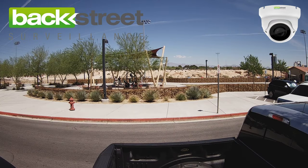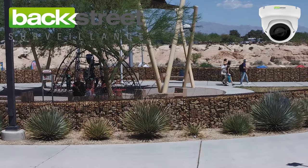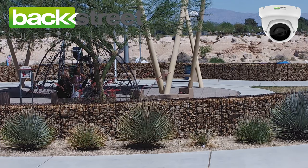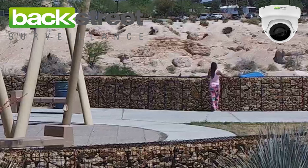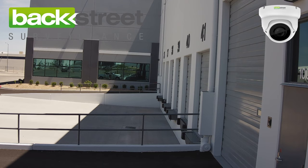The U90 VW is an extremely popular camera. It can be used indoor or outdoor. It can be wall or ceiling mounted. It's got a manually adjusted zoom lens from 2.8 to 12 millimeter. This allows it to open up at 110 degree field of view and zoomed all the way to about 65 degree field of view.